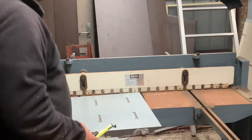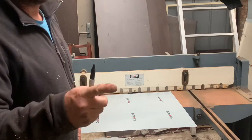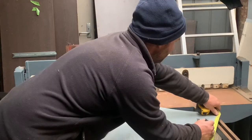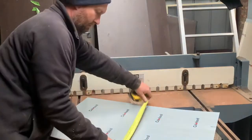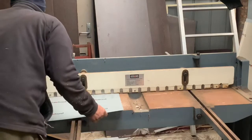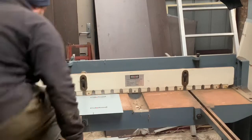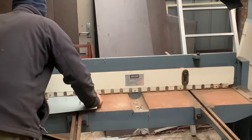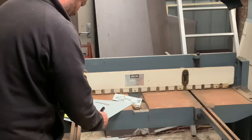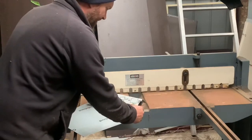So I'm going to make these dividers in the nesting box. Then I'll make them out of sheet metal. So I've got my dimensions here. I'll cut them in a guillotine and I'll go over to the folder and fold them up. So I need a 20 mil fold around all four sides. Once again, many ways of doing this.